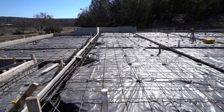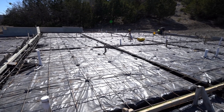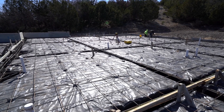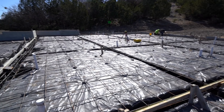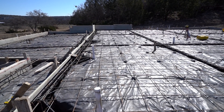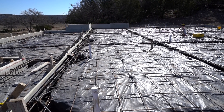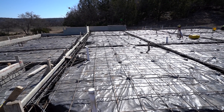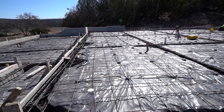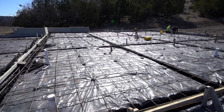That's another thing the inspector is going to be checking for. So we're waiting for the inspector — they should be here in about 30 minutes. The next thing is the plumbers; they're going to be here tomorrow. And the electricians — we still need to run all the water supply lines. Everything you see here is drain lines. Once the plumbers run all their lines and the electricians stub up any floor plugs or conduit — for example, if you have power in an island, we need to run conduit so we can fish a wire through — they will do that tomorrow. And then the day after, we pour concrete.